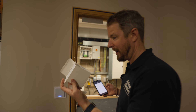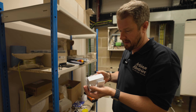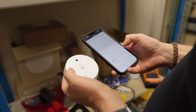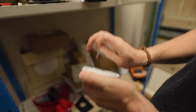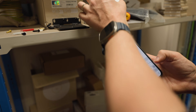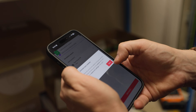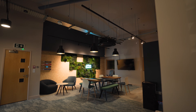In the plant room we can turn the lights on from Loxone. We also need to add a PIR sensor - these are Interact Pro with a wireless PIR so anyone walking into the plant room will trigger the lights. In the app, we go to 'controls,' 'sensors,' 'add sensor,' select battery-powered regular sensor, remove the tab to identify it, name it 'plant room PIR,' set the zone to plant room, add occupancy sensing to turn the group on and off, save, and deploy the settings. All done.